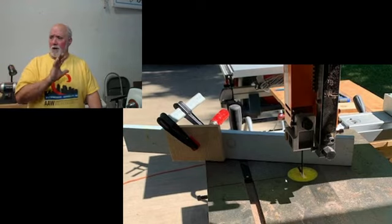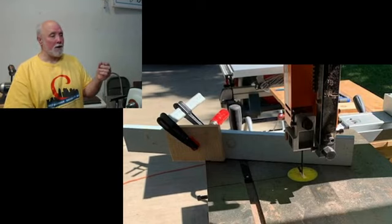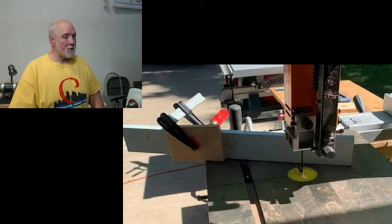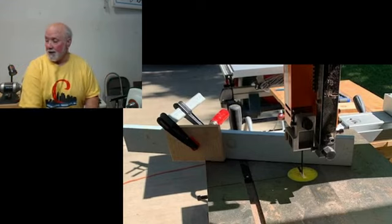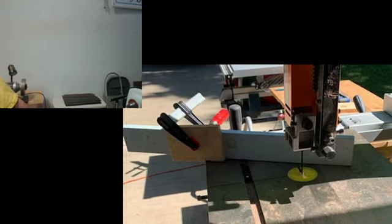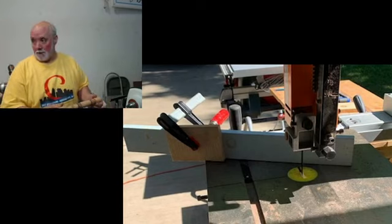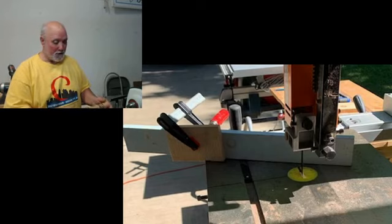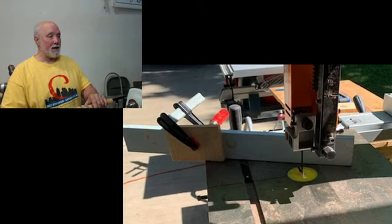I don't know if you can see it or not. It's kind of shaded, and I apologize, but this is my bandsaw. And that's what I cut my 22.5 degree on, because I wanted a thinner kerf. It was going to be so small that I was afraid that with the 1/8 inch kerf it might be just one solid color. So I made a smaller kerf, about 1/16 of an inch, where the table saw is about 1/8 of an inch. But that's how I get these different pieces. I also use a miter gauge on my table saw, and that's how I get these real thin pieces. And again, I don't take it off the saw until I've made all my cuts.